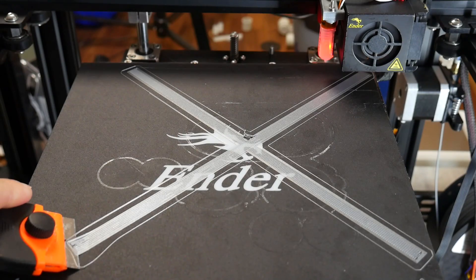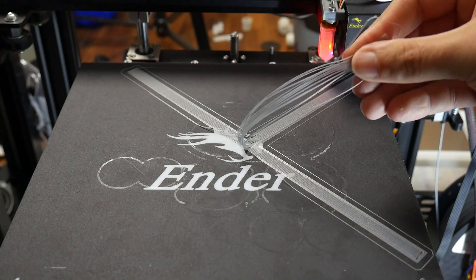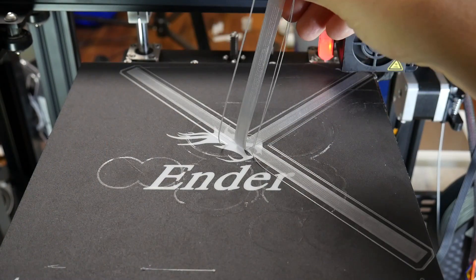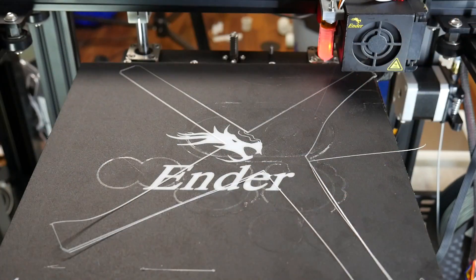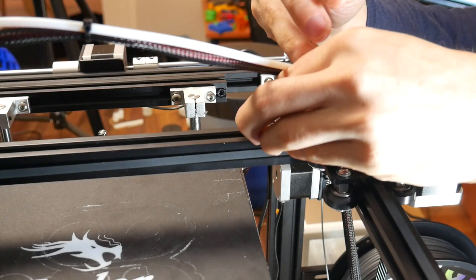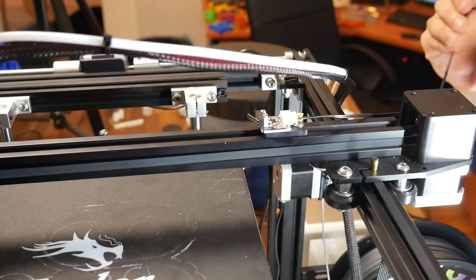Here's my finished X — I can see I didn't quite have it low enough because all of the individual strands weren't squished enough to merge with each other. I lowered the Z offset, did a second print, and this time it worked out perfectly. I've stored these settings in the EEPROM for the future but I can always do little adjustments as necessary. I noticed my X was not in the center of the bed using TH3D, so I played around by uncommenting the home adjust, but the expected changes did not occur, so I ended up sliding in my end stops to get my prints back into the very middle of the bed, and with that everything was complete.